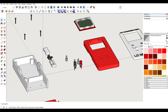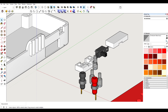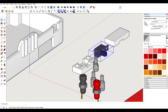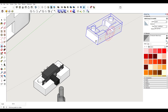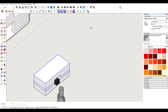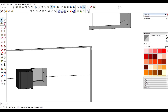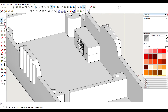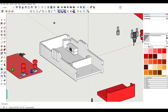This is the bottom side of the case and I'm going to start assembling everything as I speak. Here we have this cutout for the power switch, and then I have these two parts — the switch is placed between them. You may notice that I have a small offset between the parts; otherwise they won't fit together. From experience, this offset is proportional to the quality of the printing — if printing in higher quality, this offset can be smaller. Currently we're at 0.25 millimeter clearance between these parts.